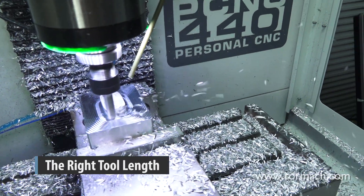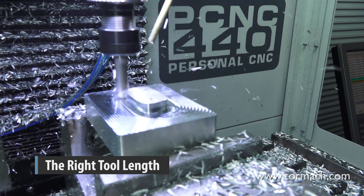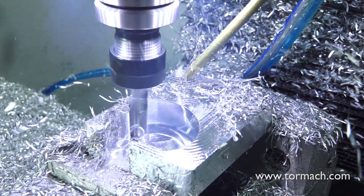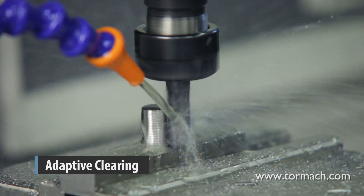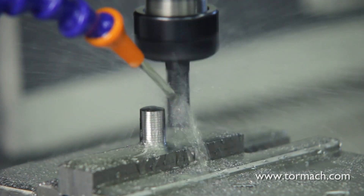Choose a shorter tool. When the tip of the tool is further away from your tool holder, it can cause deflection and eventually breakage. Shorter tools make your cutting more robust and solid, meaning more of your machine's power goes into cutting the stock, not breaking the tool. Using adaptive clearing is also helpful for preventing tool breakage and deflection. Adaptive clearing helps to reduce the width of your cut and use more of your flute length, which applies more pressure along the length of the tool rather than at the tip.